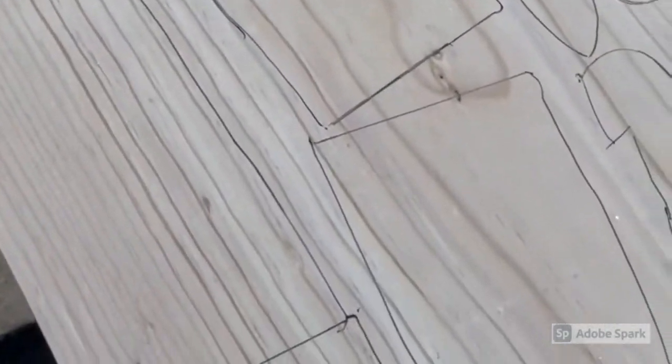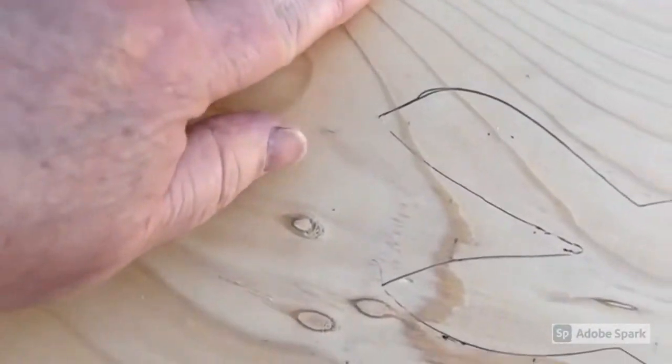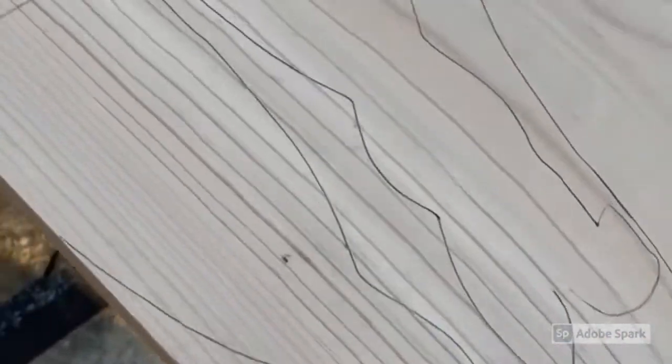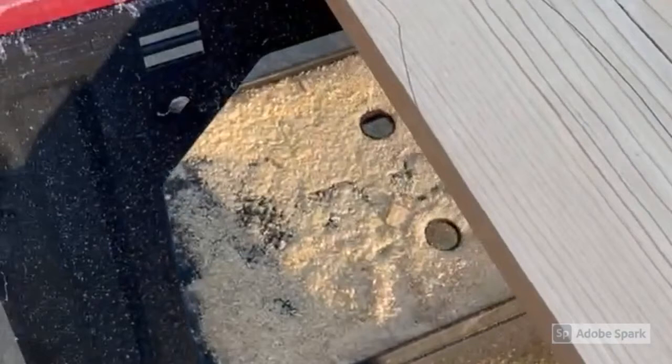I used a piece of white pine board in a size 1 by 12 to do the project. I have three different size rabbits. My patterns range from nine and a half inches to 13 and a half inches tall. I traced these out on the board, avoiding the knots in the board as those would crumble when you would saw that area. I got many different rabbits per board, and once they were all traced out, it was on to the sawing.